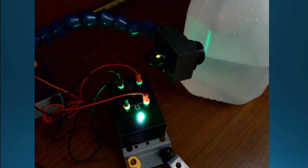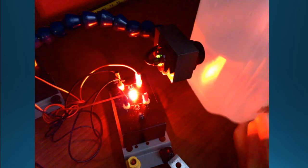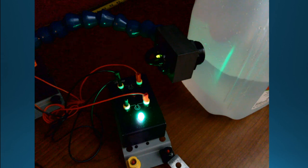But, you know, if you get gunk in there, right, it doesn't dry out, doesn't work out so well. So that's where your capacitive sensors come in, because they're not in the material, and they're not going to cause that to occur. And I guess if you really thought about that, that other sensor could calcify in there. It could change the way it behaves. All right, so that's the capacitive sensor. Again, it's oftentimes used for detecting fluids, but because it doesn't detect only metals, it can detect any type of material. It can be tuned to detect whatever presence you're looking for.